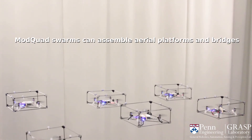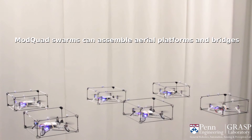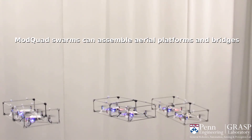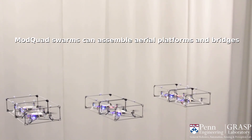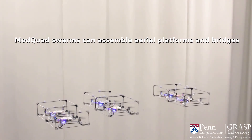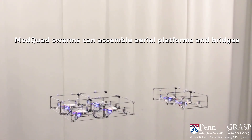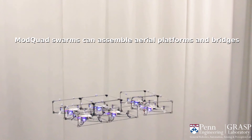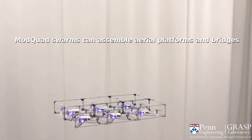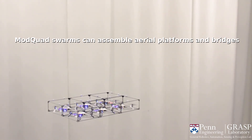The structure is composed of agile flying modules that can easily navigate in cluttered environments. We present a stable modular attitude controller to allow a set of attached modules to cooperatively fly. Our controller generates the required moments that minimize motor saturation, because connected robots generate what is essentially a new vehicle with a larger inertia tensor and different dynamics. This system is redundant, but it is necessary that the structure be coordinated and that the method of doing so is generic in order to form arbitrary configurations.